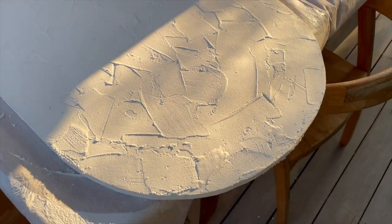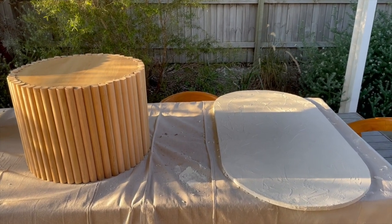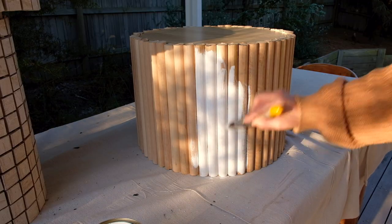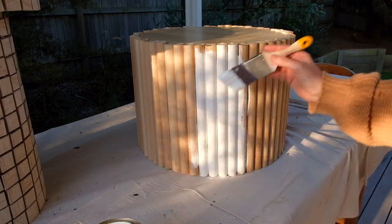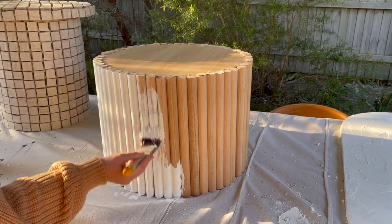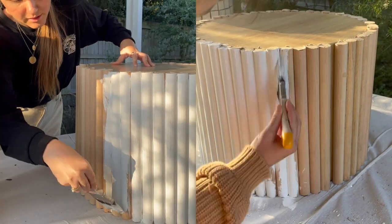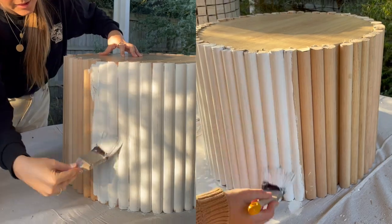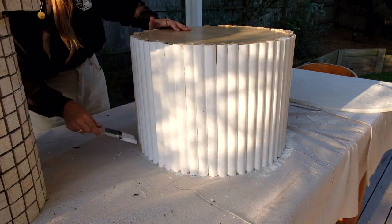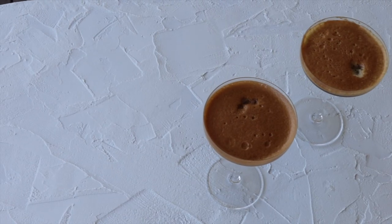The first bit of render I applied was quite dry and not spreading easily, so I put it back in the bucket, added more water to create a more liquid and fluffier consistency — highly recommend doing that. I continued around, cleaning up any bits and making sure all edges were covered so you couldn't see through to the sheet, then finished with back-and-forth patterns to create that nice minimal texture. We are so happy with how the fluted bottom and rendered top turned out. We added one coat of paint around the base then two more coats, and the table was pretty much done.